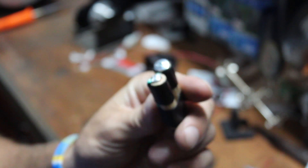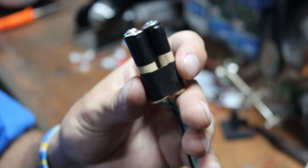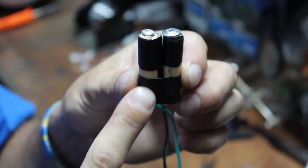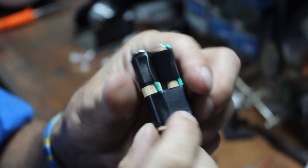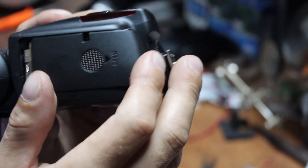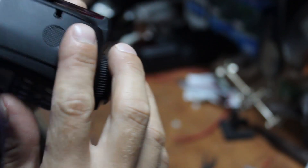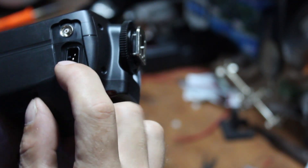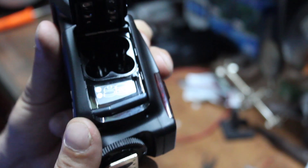Fake batteries — that's right, fake batteries. I used two different sized screws, though you can use the same — it doesn't matter. I used a wooden dowel cut to the same size as a double-A battery and taped them together with some wires. On the door, I had to file a little hole so that the wires can fit through. The other tutorials I found online actually went through the mount and hardwired straight inside. This way, using the fake batteries, you can always take those out and then put in regular batteries.